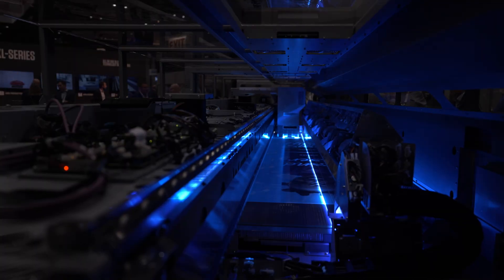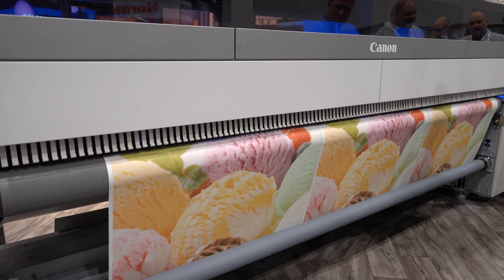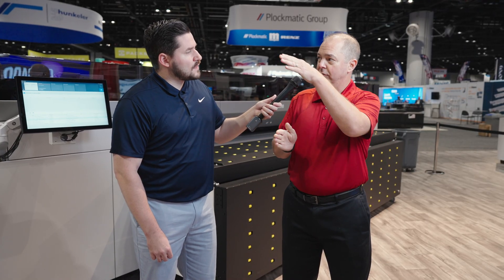We also have DMC, which is fine-tuning. We can actually move the heads in the head chassis — just micro movements — to make sure that your alignment from pass to pass or side to side is correct. It can actually accommodate for a skew in the media that's being stretched, so that when it gets unstretched you have a straight line.